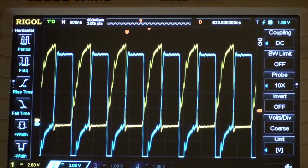Because a 1N4007 is practically the worst diode you can get on the market. Like, that's how it is. It's a general purpose rectifying diode. It's not really that good. So a UF4007 is, at least according to the datasheet, superior, but this one isn't, which is horrid. So I didn't expect to get that, but yeah.